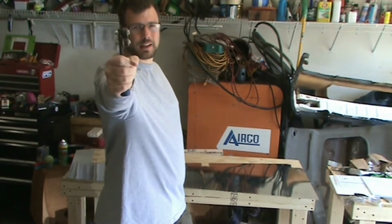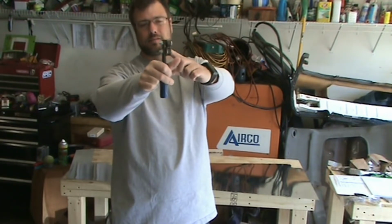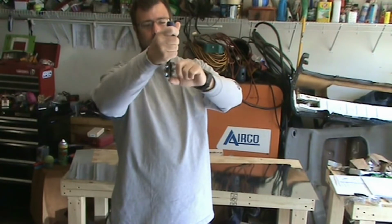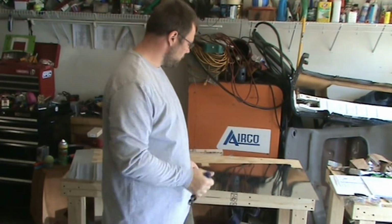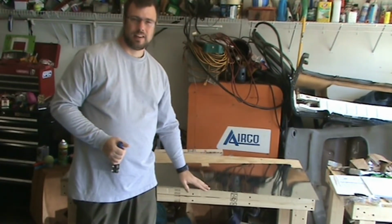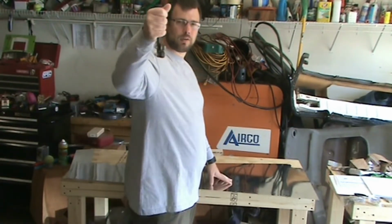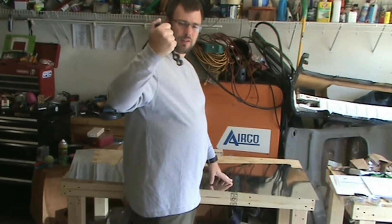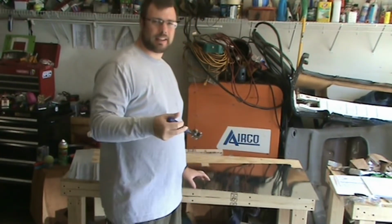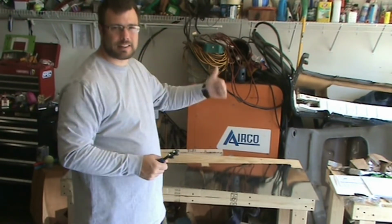And basically you just put the skin between the rollers and then it bends in this orientation a slight lip up. So this way it would bend down. And you want the outside of your skin, the bend, to go away from that. You want it to go to the inside of the skin. So either I have to hold it in this orientation, which might be the way to go, or I need to flip the skin over so that I can hold it in this orientation and the skin will be facing with the inside up.